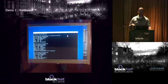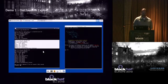And I did the kind of standard script kiddie thing where I'm like, oh, okay, let's do a little nmap on the device and see what's out there. And when we do that, we notice, hopefully it's kind of visible, we see, oh, port 445, that's our old friend, right? We all love port 445 because what's on port 445?